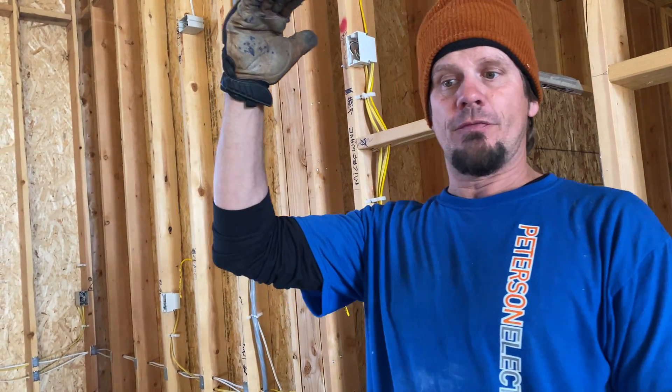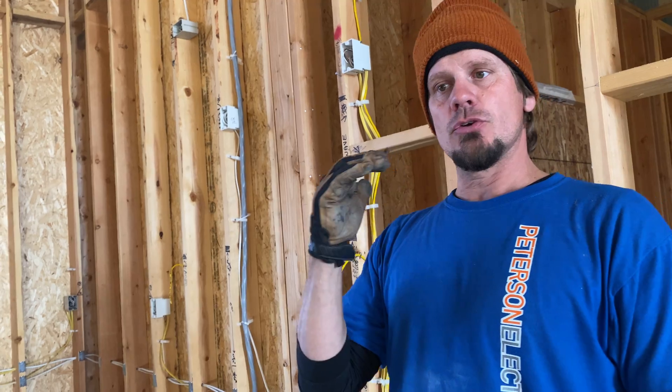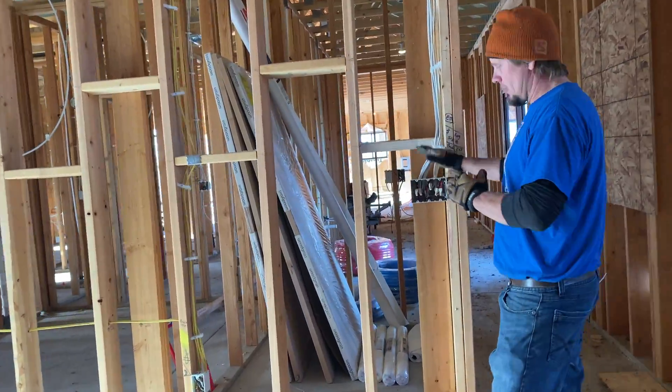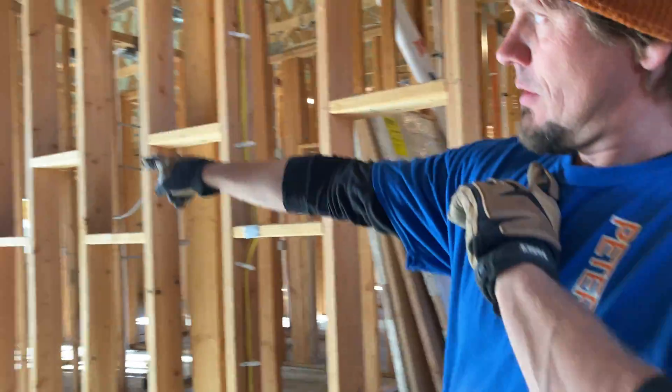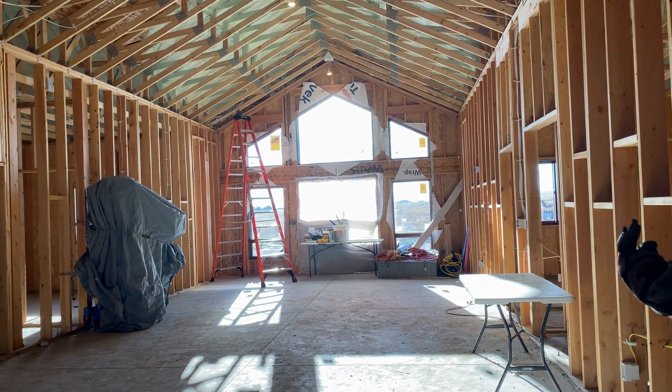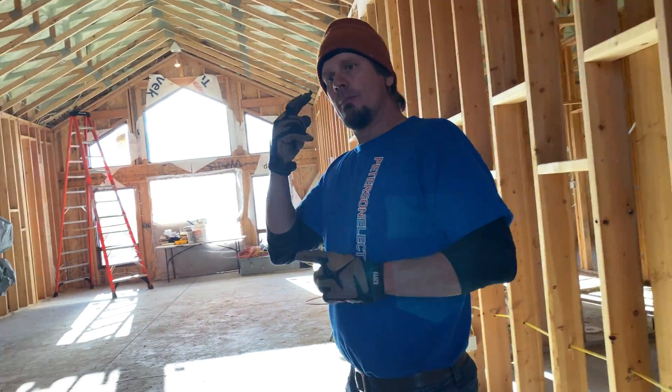You could fill up a 42-circuit panel — that's fine. But you've got to remember that your generator is going to start making funky noises if it's off balance leg to leg. On top of it, you've got to make sure your loads aren't too heavy. Thank God we're in the LED world because all my light bulbs in here are like 14 watts on some of my Nora trims, so I don't have to worry about that. We did wire one circuit that did all of this — our four-way system back here, to the owner walking out of the master, and over there to someone walking in the front door. So you've got a five-way system going, and we have one emergency circuit for that.